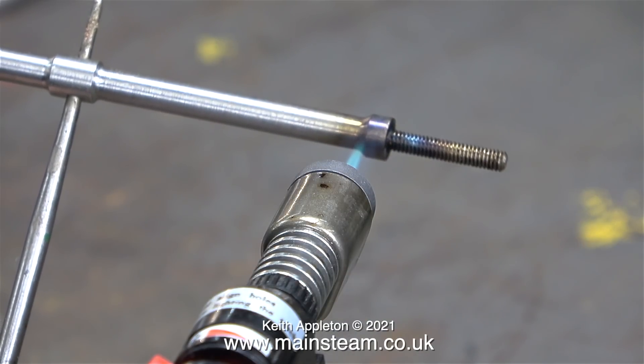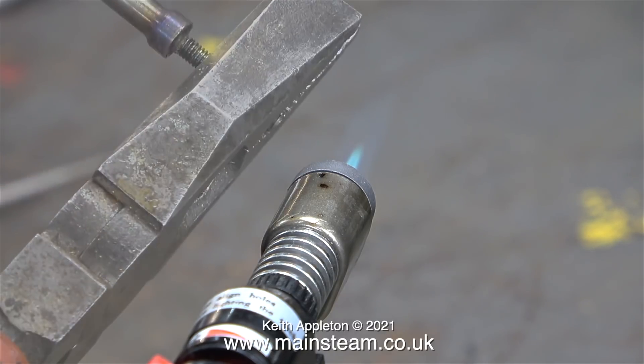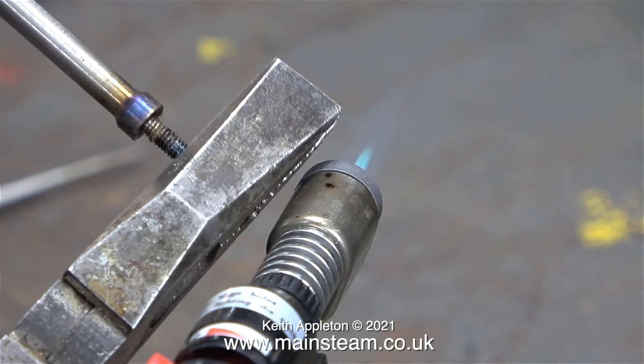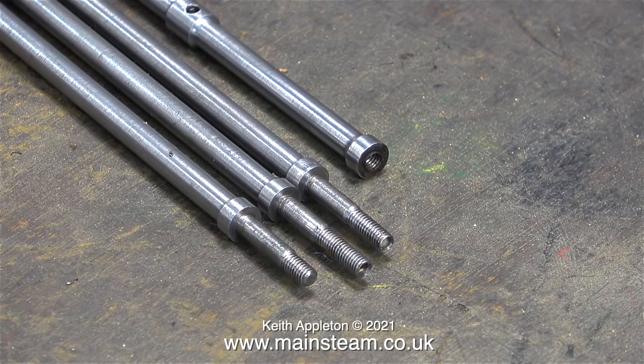The parts don't need to be heated to red — in fact even this is a bit too high a temperature. With my scriber through the hole in the center of the column to give me some leverage, I simply unscrew the column from the bolt, which I'm holding in the jaws of a pair of pliers. Here's the modified part sat next to the other three columns. You can clearly see that the size of the center hole is a bit on the big side. The one on the left hand side of the picture is shorter than the others, and I think this has been done on purpose so that the fitting clears the hole in the box bed.